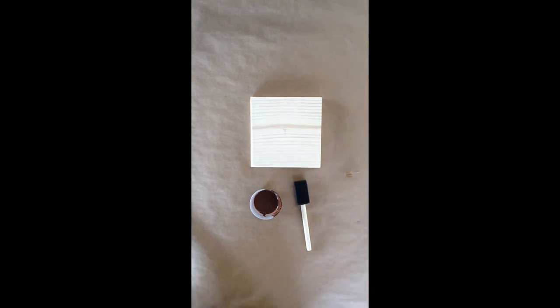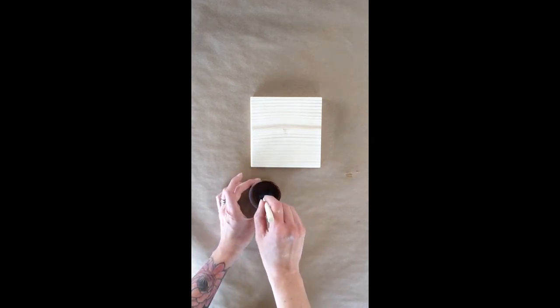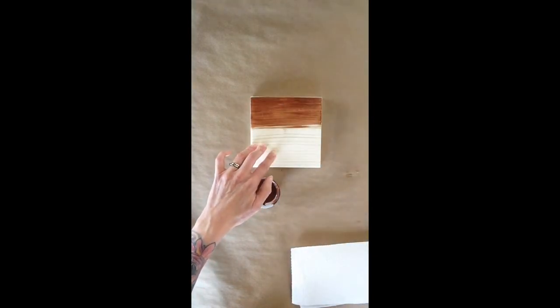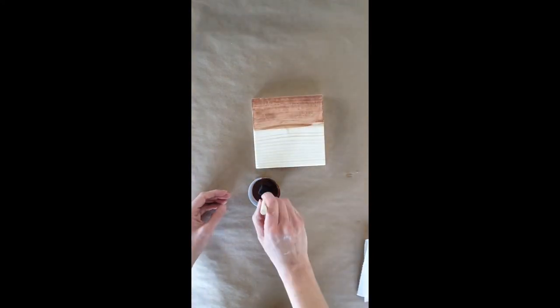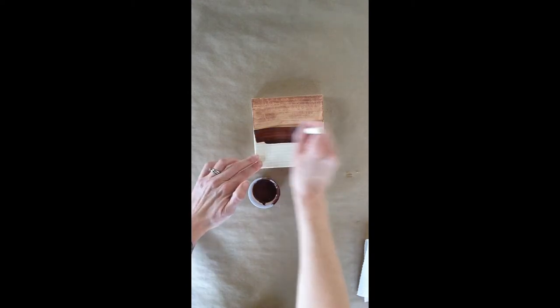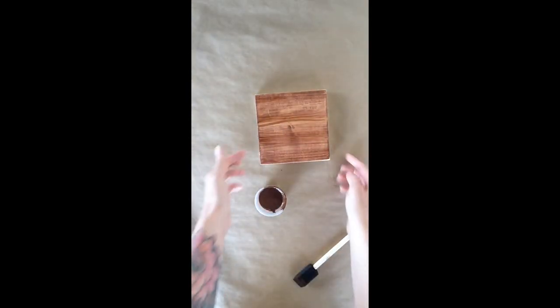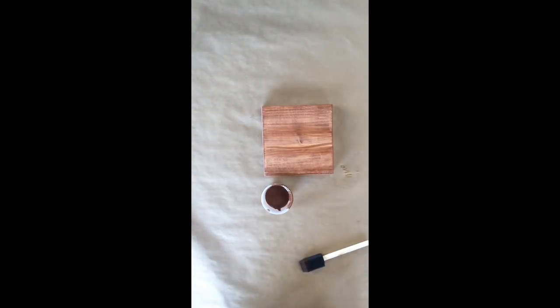If you're just using your paint, you're just going to give it a nice thin coat — make sure you get the edges and make sure that it dries. For the wash, if you've added water to your paint, we're going to add it on. This is going to be a similar idea to a stain where we put a coat on and then wipe it off, so we want it nice and thin so we can still see the grain in the wood. You can continue to add layers until you have the color or shade that you would like. Be sure to get your edges as well.